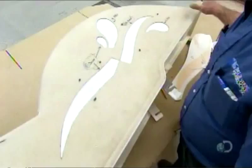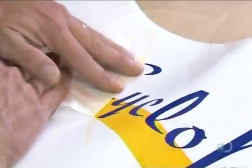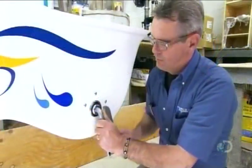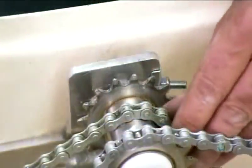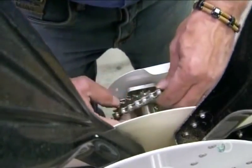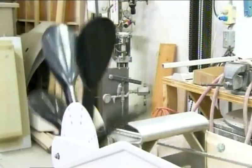The part of the boat where you sit and pedal is called the bicycle. The two bike bodies, like the floaters, are made of molded fiberglass, then jazzed up with decals. Since the bicycle mechanics are routinely exposed to water, they must be rust-resistant. Therefore, the pedal mechanism is made of chrome-plated steel, and the chains of steel that's been treated with an anti-corrosion coating. Each bike has two chains: the first linking the pedals to one side of a central gear, the second linking the other side of the central gear to the propulsion wheel. So once they're both hooked up, pedaling moves the first chain, which rotates the gear, which moves the second chain, which turns the wheel.